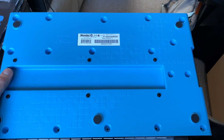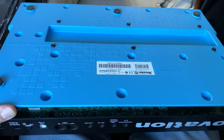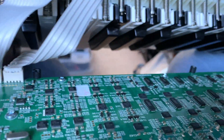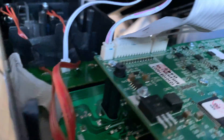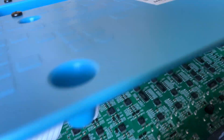When you've done that, keep it upside down, twist it so that the keys are facing away from you, and then when you lift up, you'll see you've got this ribbon cable here. The keys kind of hook on to the bottom of the case, so if you lift it that way you don't want to pull it too tight because you've got these wires here that are stuck down. Essentially what you've got to do is unplug those and plug them back on. They've got little clips just on the rear of them — so all you do is push those down and lift the cable out. Just give them a little squeeze and then pull.